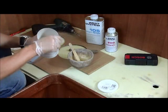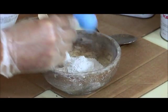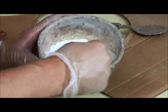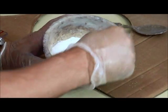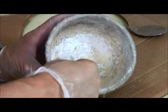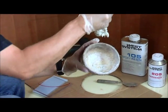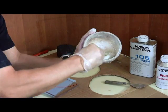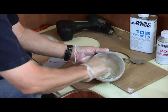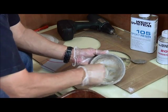We need to make sure it's fully mixed and now we're just going to add the powder. The ceramic bowl just seems to restrain the very quick curing reaction that comes at a rush as the chemical reaction completes its cycle. As you can see, that's a nice thick relatively stiff mixture — that's the consistency we're after so that it will stand up in the corner and won't sag down and run out of our perspex.